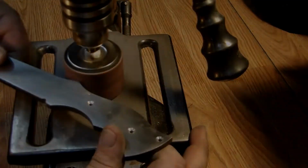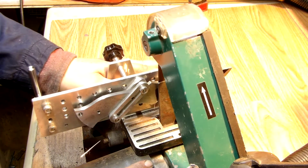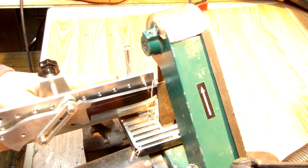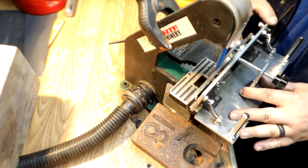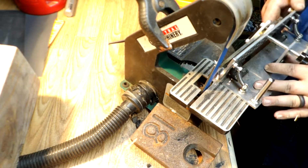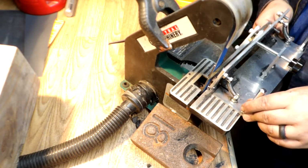But what this does for the knife is, it makes the knife to where it can hold a good edge. And when you have a knife that's made out of soft metal, it doesn't stay sharp as long. And so if you have a knife that stays sharp forever, it was heat treated, and somebody knew exactly what they were doing when they were making that knife. And you know, when you see knives that are $200, $300, $400, $500, you about guarantee those knives were made by a knife maker who had plenty of years of experience.